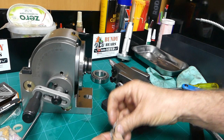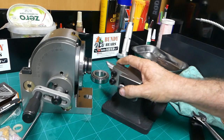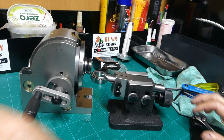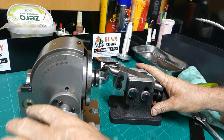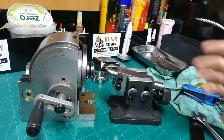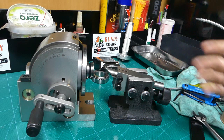Fat washers fitted on the tailstock, replacing the thin ones originally supplied. That's all done. A couple of boxes and old bearings to go in the bin - and the original dodgy key if anyone wants one. That's the end of the video on the BSO semi-universal indexing head. Gone from a cheap Chinese tool - $360 - with a Timken replacement bearing at about $20-$23. We now have a good, reliable, usable tool with all the slop and backlash taken out. For a hobby home workshop, it'll be the duck's nuts. Thanks for watching.